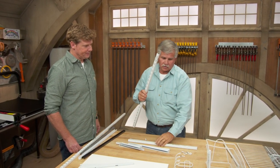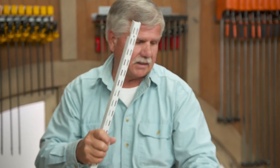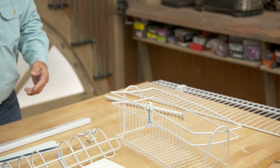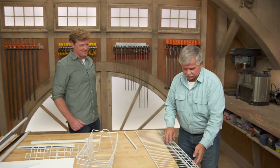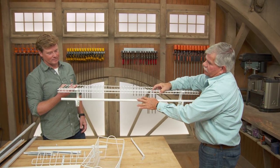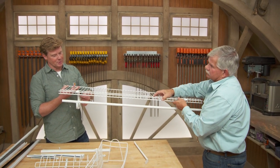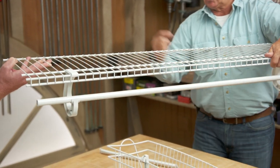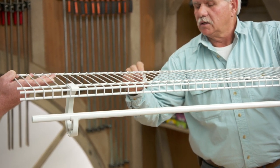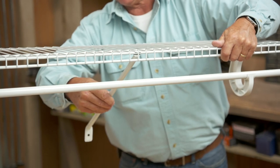Here's a different way to mount them: this is a bracket that you mount to the wall, find the structure, and screw into that. Then you take the standard and put it in this track. This allows you to move it anywhere you want without worrying about these going into structure — this carries the weight. The adjustability comes from here. You want to put something in the drywall — usually a rivet like this. You drill a hole, slip this into the wall, push the rivet through there, and that holds it in position so they don't swing — it just stabilizes. They have all kinds of attachments you can attach to the standards too, like mounted ties, or a basket if you want to put a pocketbook. Then you have wire shelving — these come in all different widths and lengths. Here's one where you can mount this for hanging your clothes, so you can slide them, and the hangers won't move. This just clips in so you can make this any length you want. You always want to mount it into structure with a bracket. And you want to support the front, so you use a diagonal brace that goes into the bracket there and mounts to the wall.